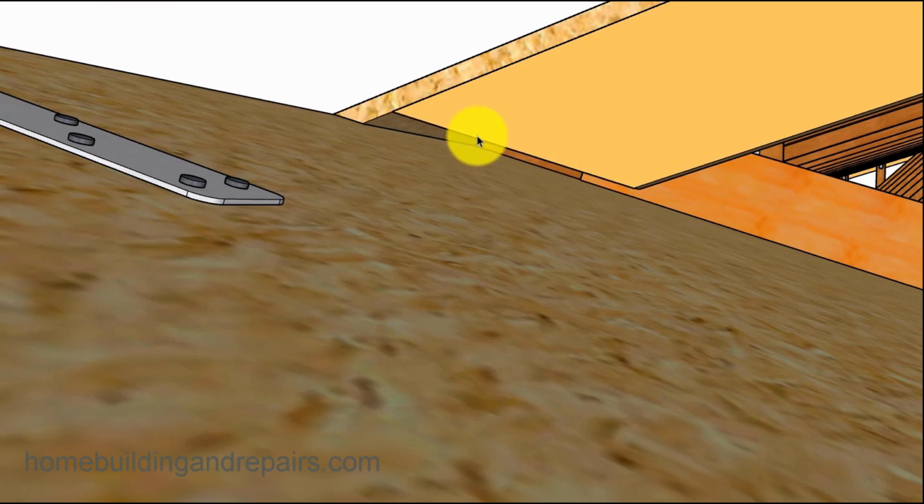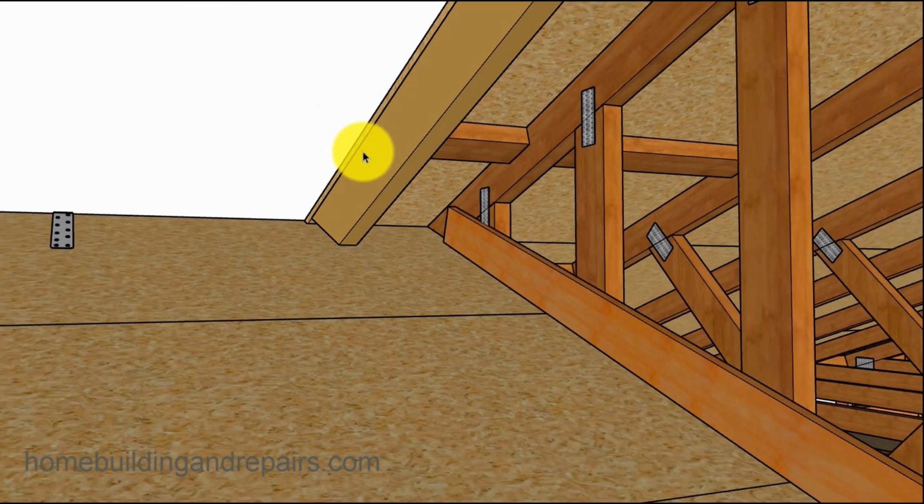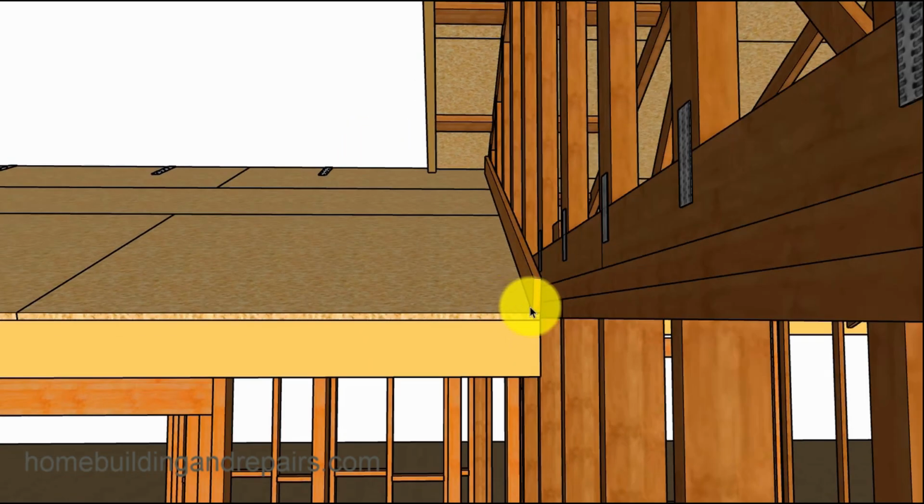And here's an example of the fascia board that we cut. Here we now have a 1 inch space between here, which would probably work out fine for composition shingles. And then you would roof underneath that. So your roofing materials would go under here. Now, if you notice, I have a 1x4 here. This is going to be so that you can install some type of metal for the waterproofing. I say waterproofing. I don't like to use that word. Water resistant. It'll get a piece of metal here.